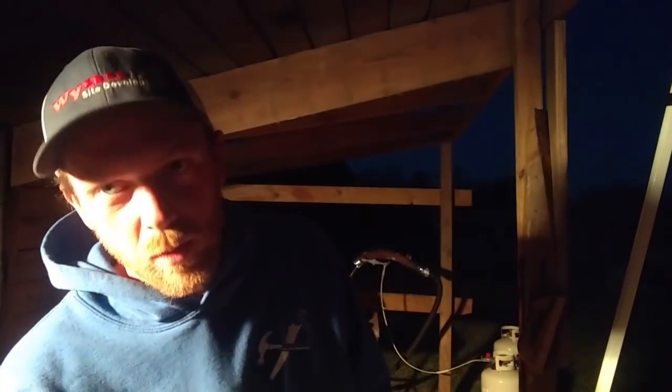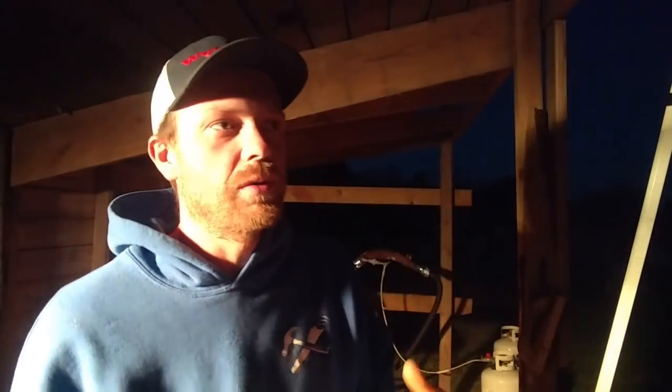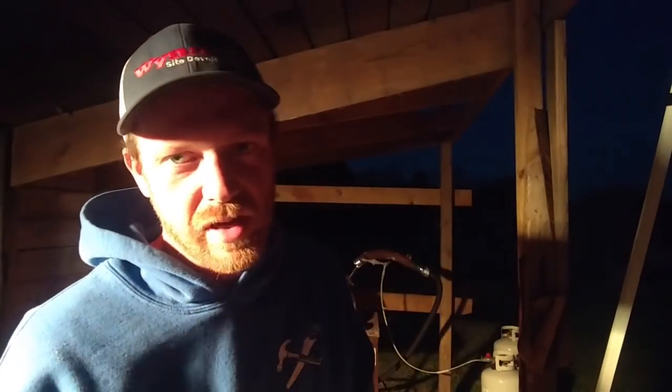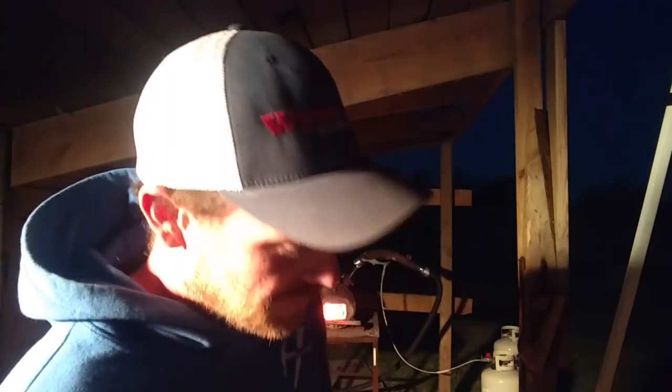Again, with the K-Wool, please use your safety gear. Stuff's dangerous. It's a very, very big health hazard. You don't want to bring those fibers in when you mess with it. It's a ceramic fiber, and it's got all kinds of other nasty stuff in it. Definitely wear a breather. Long sleeves are to prevent it from itching because it's like fiberglass. The goggles are to prevent it from getting in your eyes, especially if you wear contacts like me. So wear your safety gear.